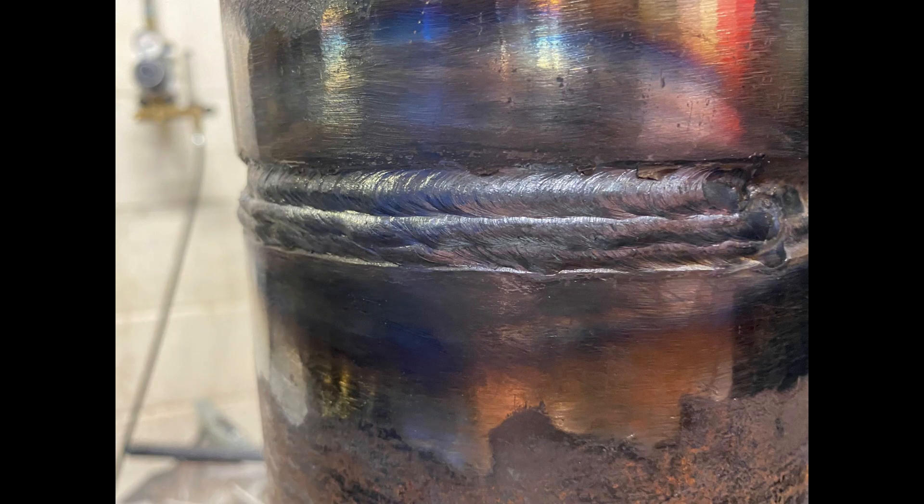Third and final run to flush — same as the previous layer, we haven't left it too tight so that we can actually fuse into the bottom. Flush complete, we then move on to the cap. We're going to cap with three runs. The first run you're following that bottom edge, burning that bottom edge away and using it as a guide to give you a line to follow.